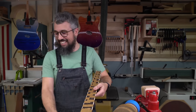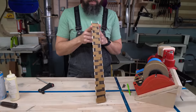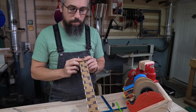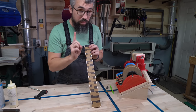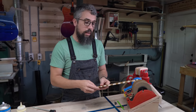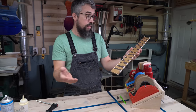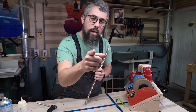What we have now is a bound fretboard that is pretty much structurally done. Once this is dry, the last thing I need to do is run it through my drum sander — or you could use a hand plane — to take the top flush and be very careful on the backside to get it absolutely flat so that when you glue it to the neck it's good to go. Before I glue this down to the neck, which we'll talk about in the next episode, I would go about radiusing this to my desired radius. With that, I think we are ready to be done with this episode — I hope you guys learned a little something, make sure you subscribe, and we'll see you in the next one.